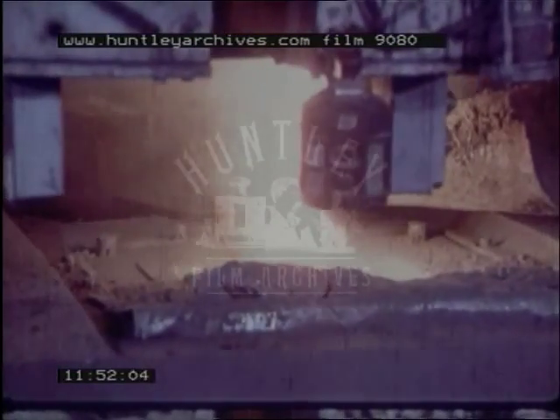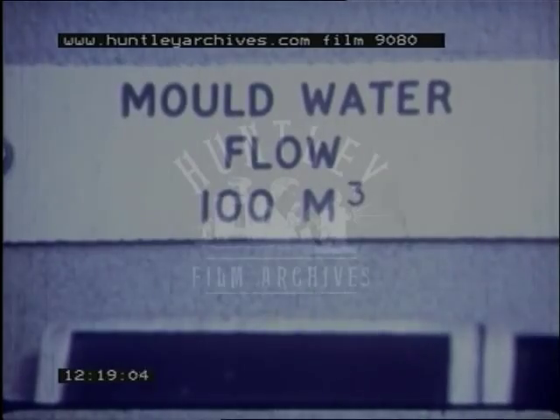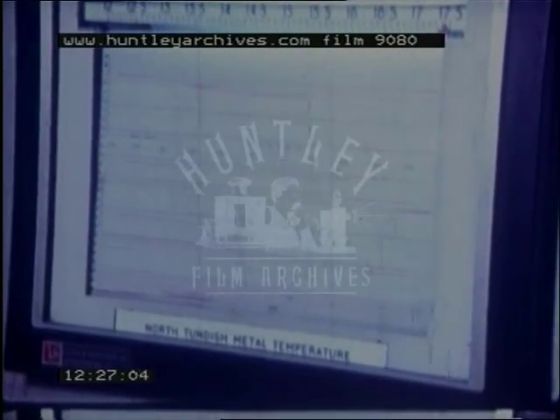In any given cast, strands of several different sizes may be formed. The appropriate flow of steel to each mould is obtained by using tundish nozzles of different sizes — the bigger the mould, the bigger the nozzle. The strand takes about half an hour to pass through the cooling zones, and its progress is followed in the control room. On this plant, there are eight identical control panels, one for each strand. Various aspects of the casting process are monitored and regulated: the temperature of the mould cooling water, rate of water flow, rate of oscillation, casting speed, tundish temperature, and casting time.